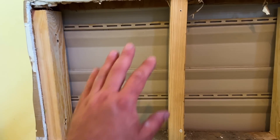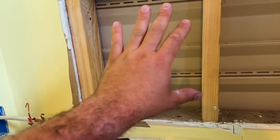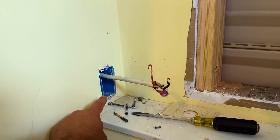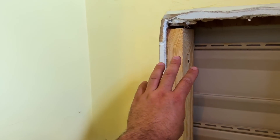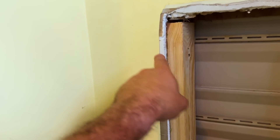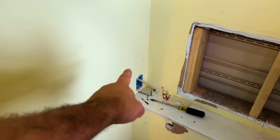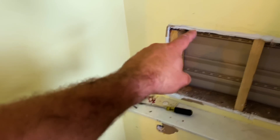We'll show you on the outside. We had some old siding that we were able to use — it's not a perfect match, but it's kind of in an enclosed, non-visible place, so it doesn't really matter. This is a dedicated 220 10-gauge outlet that was specifically for this AC. We have the power killed to this, and we want our disconnect to be on the outside right here somewhere. So we're going to take a drill bit and run it through this corner into the utility room. This is the wire that comes down and goes right into this box. We're going to try and miss this finished drywall and run that wire straight through and put our disconnect there.